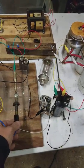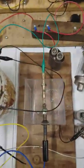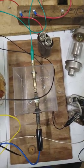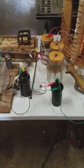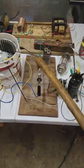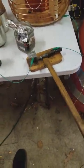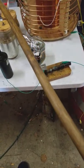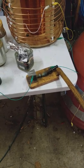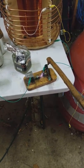This spark gap is a little unstable of course, but interestingly enough when it's almost touching — in fact it is touching — I get this effect where it still wants to arc at a much faster rate. What's really interesting about these two coils is that because they're wired backwards and in hairpin configuration and in coil shorting configuration, the voltage output of them is ridiculous. Their secondaries are basically arcing over through the capacitor bank and through the primary conductor.